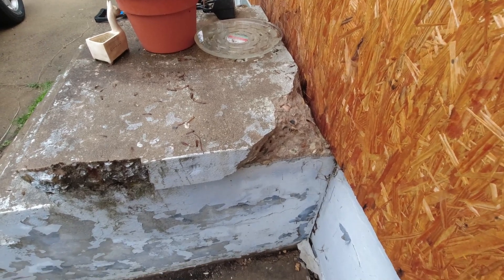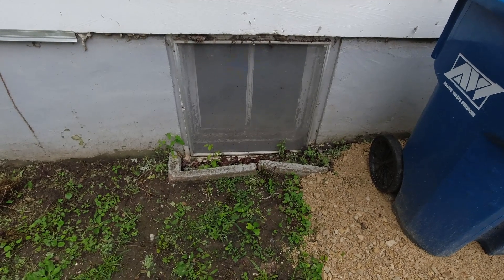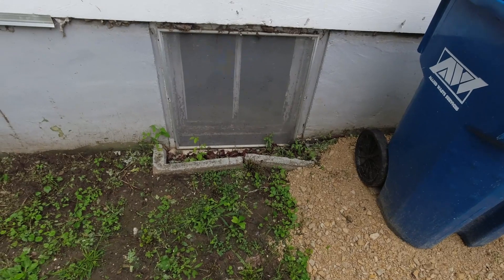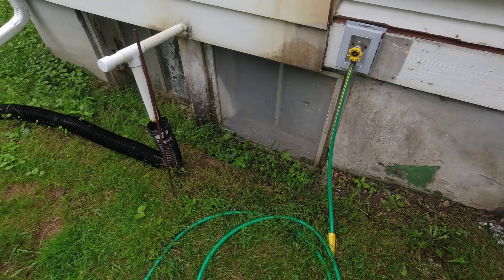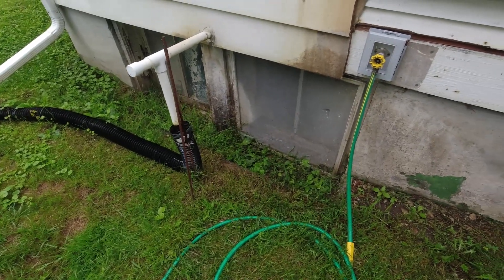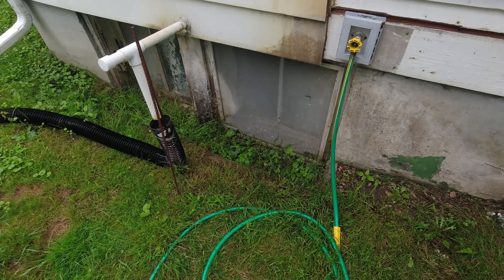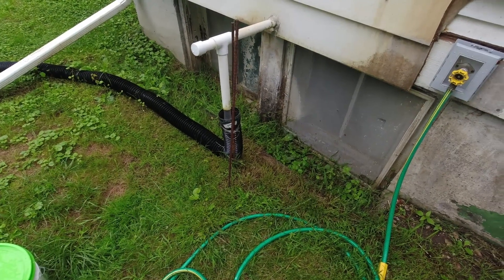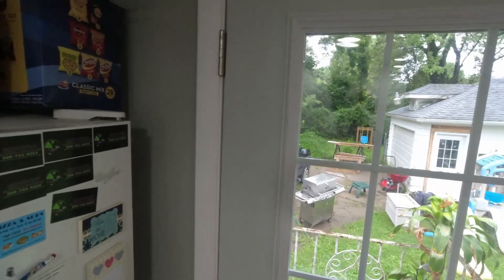It's going to need that jackhammer, and I am not looking forward to that because I'm getting a little old for that nonsense. Another upcoming project is the basement windows — they're not in very good shape and they're old. I need to replace all of them. Some we're going to have to block up and make smaller. There are two windows side by side that are actually below grade, and with a big heavy rain that's a problem — we already have a water problem in the basement. The idea is to add a layer of concrete block to bring it up above grade and put some smaller windows in.